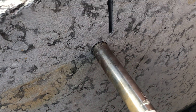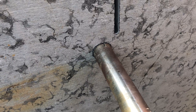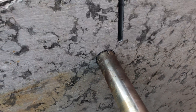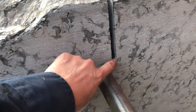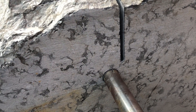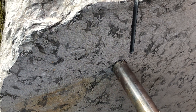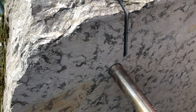What I've done is traced a circle around where the drill hits. Now I'm going to measure the offset between here and the center of this hole. That will give me the offset of the core drill, and I can program that in as a tool in Commotion CNC.